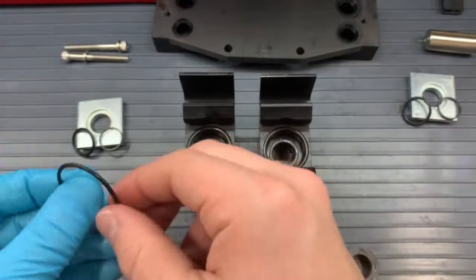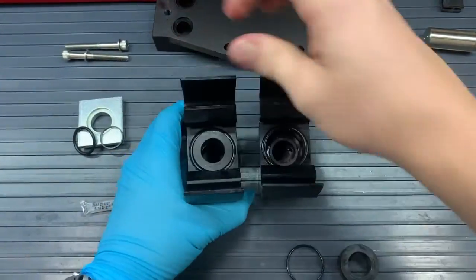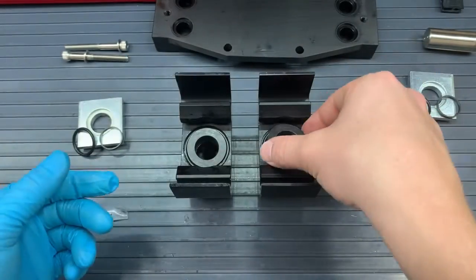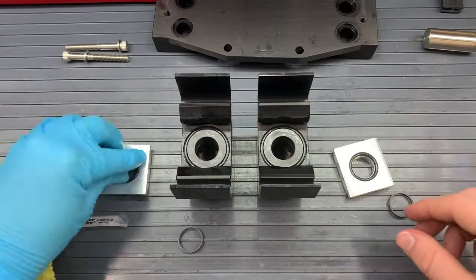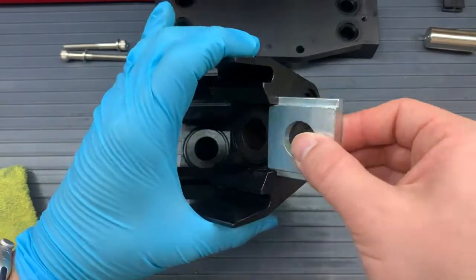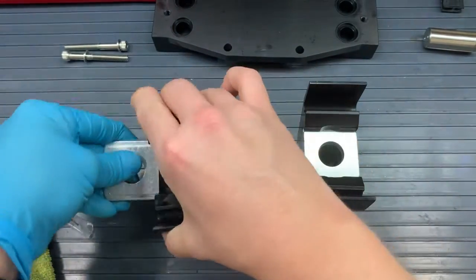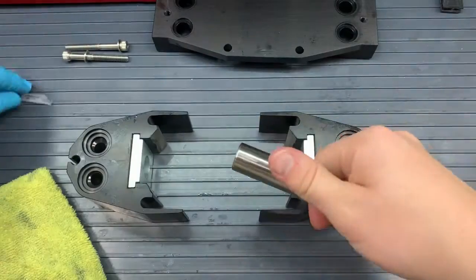The plunger guide and another O-24 O-ring will be going into that opening. We have our plunger guide and we will grease our O-24 O-ring, positioning it around the plunger guide in the divot you see there. With the smaller portion oriented into the pump, push the plunger guide in, making sure it sits flush with the seal bore opening. With that in place, grab the retainer plate, the seal ring, and the 117 O-ring. Place the seal ring concentrically within the 117 O-ring so they are together, then slide the retainer plate over the seal bore opening. Make sure everything stays in place — if it doesn't fit, something may be out of position. Make sure you're doing this for both sides.